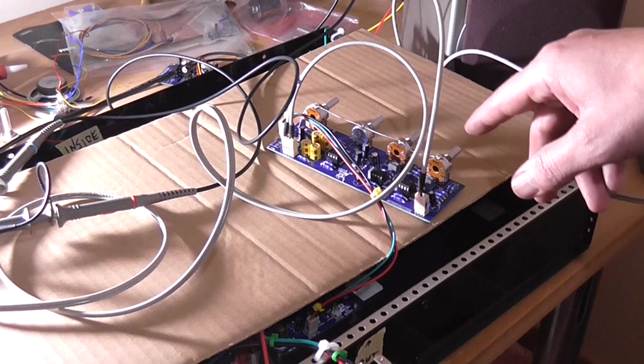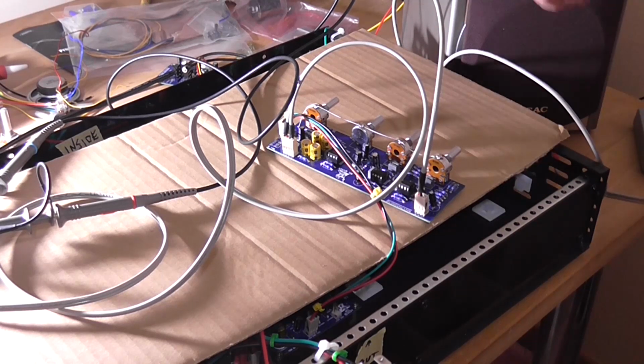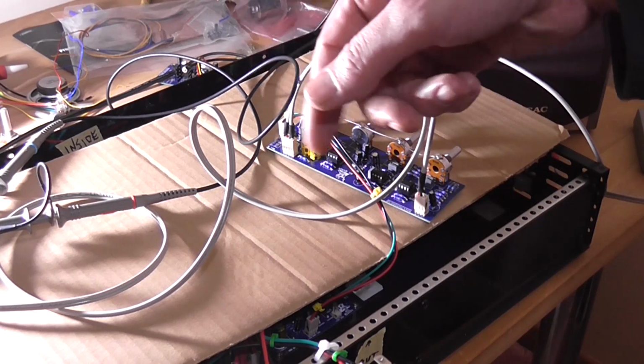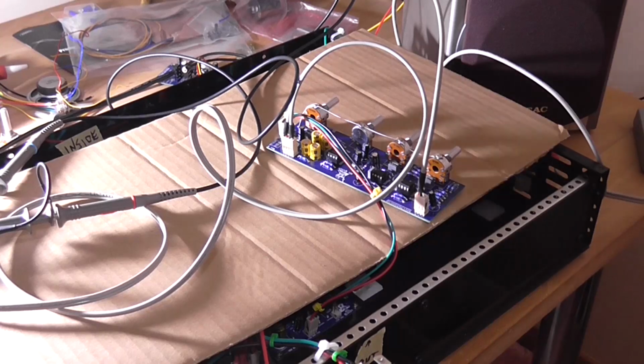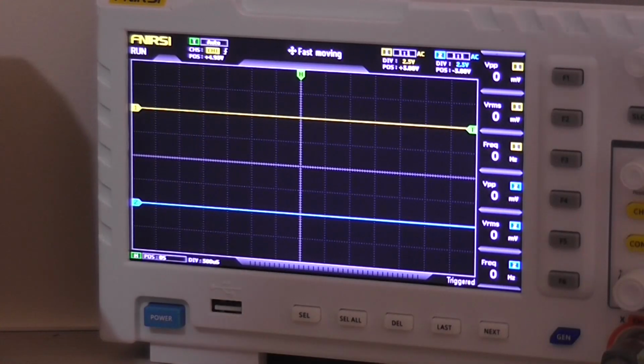Now I've got the input hooked up to my oscillator off of the oscilloscope, both channels, and I've got the two channels of the oscilloscope connected to the left and right channels respectively. The yellow trace is my left channel and the blue trace is my right channel, and the volts per division on both is set to 2.5 and we're in times one. So if I turn the power on,